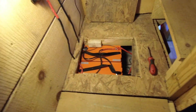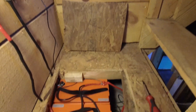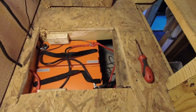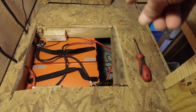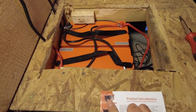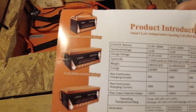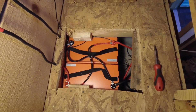Now we're going to look at what's under the floor. This access door is roughly cut — my jigsaw blade got bent somehow — but it's going to be under the carpet anyway so it doesn't matter. This is a pretty good place to put the batteries. I've got room for probably one or two more. What I have here are two 100-amp-hour Chins batteries — that's the brand name. They're 100 amp-hour, 12.8-volt lithium iron phosphate batteries.